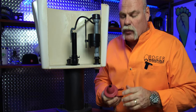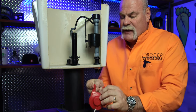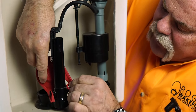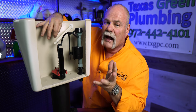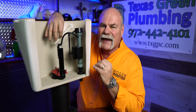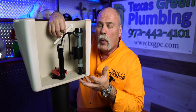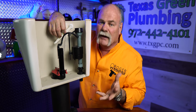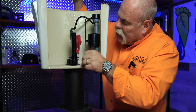Now we're going to install the new flapper. I'm actually going to put the same one back in because I know it's the exact one for this toilet — but look at the difference. See how this one has the little metal clips? Some just have rubber that hangs over it. All you do is clip it around the ears there and make sure it seals off real good. There's not a homeowner out there that cannot change their own flapper, and these are inexpensive. Even if you rent, go down to the hardware store. If yours attaches differently, just grab the bottom and pull it up to unhook it.